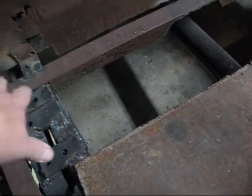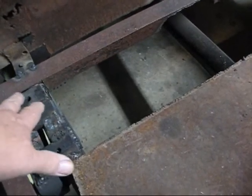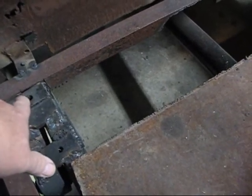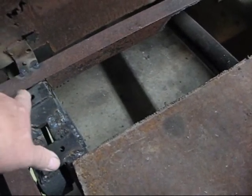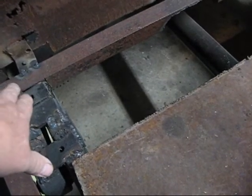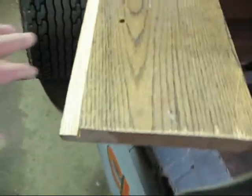So I'm going to grind the board a little bit, make it smoother on the edges, set it over in here, drill my holes, line up my bolts, weld that nut right there on the ends of the frame, and get a carriage bolt that'll fit through it and put a nut and a light washer on the bottom side. That will be board number one. I've made my boards so that each one overlays the other, so that each one will kind of tie the other down.